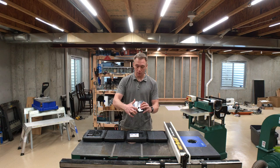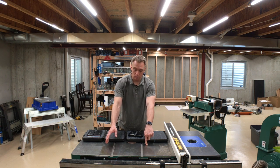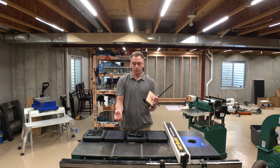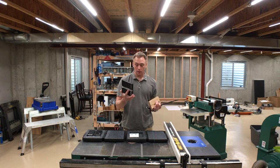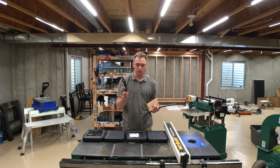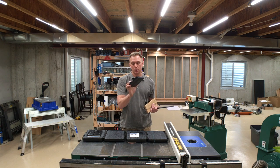One thing to note — you might notice how this plate looks like it's been sanded out a little bit. When I got this Grizzly table saw, the tracks were narrower in some parts and I had to grind them out. My cross fence has little plates that I adjusted so they were spaced appropriately for the widened tracks, and I had to do the same thing on the miter plate. It's aluminum — it took like five minutes, no big deal. For the vast majority of users you won't have to mess with this at all, but I wanted to mention it in case you were curious.